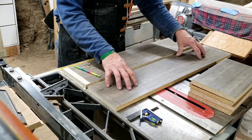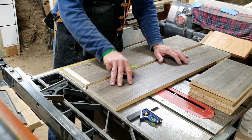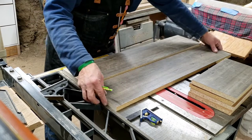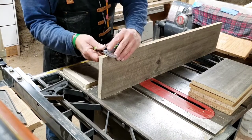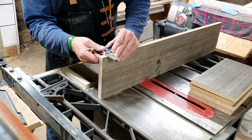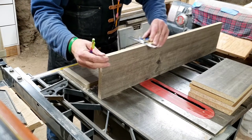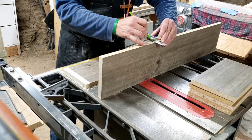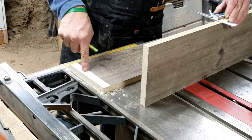At my top, bottom, two sides, and two dividers I've already laid that out on one of these boards and the spacing is correct based on the size of my containers. What I'm going to do is transfer these marks to the edge, because in the next step we are going to prepare our glue joint like I've done on this board right here.